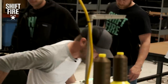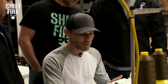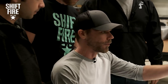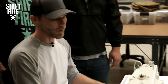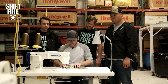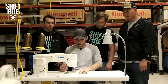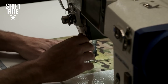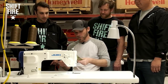This machine here is a standard straight stitch sewing machine. This is the machine that gets used probably 90% of the time in our facility. These happen to be the newest Juki DDL 9000s — they have the touchscreen, everything's automated and very consistent. We did that so you don't have to worry about one operator having their tension too tight or too loose. Every product is going to be very consistent; as long as the numbers are the same on the machines, the stitches come out the same. So like the piece of Velcro we cut on the strip cutter — we can stick it right here. These machines have an automatic start tack and end tack to make sure the beginning and end of that stitch has been zigzagged back and forth to be strong. It's going to tack it and cut the thread automatically.